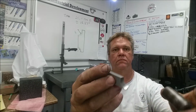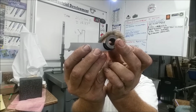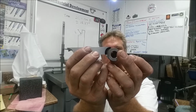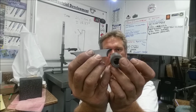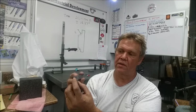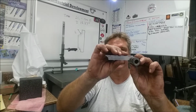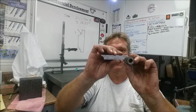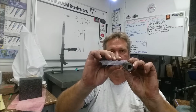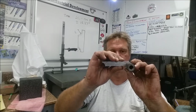And here's our result. I don't know, maybe I can line it up so you guys can see down there the amount of daylight coming through there. And so we get the right angle there. Both grinds had ended up touching at the ends, and probably less than a thousandth, just enough to see some daylight through that center there, one lined up square. As soon as you roll it back like this, it starts to contact in the center, and then you've got light in the back. So when rolling it back onto that rear relief, it gets tight in the middle and loose on the ends.